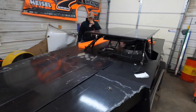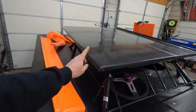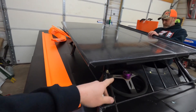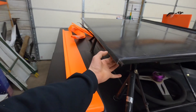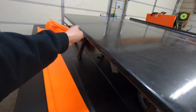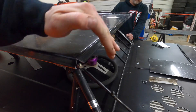So if you remember I was telling you we're going to build this in two pieces, so we can be a total of 50 inches wide. All we did was take the 48-inch wide piece of metal and did all our bends. I don't know what we're at now - 43 or something. So we're going to take from here, go out and make a filler panel with a 90-degree bend, rivet it together, do the same on the other side. It'll have a seam here on the outside but that just strengthens it up - and that's how I build my two-piece roofs.